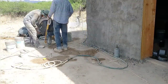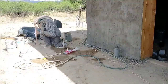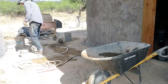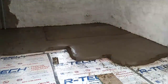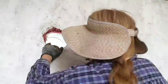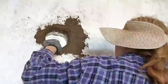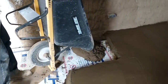There's a lot of good honest labor involved in this type of construction, and it's a lot of fun to be able to gather the materials you need from the land. We've harvested the sand from the land, we're sifting the soil from Kyle's own property, and we're putting that together with a little bit of Portland cement to make the floor. The end product is a really great floor — very natural, feels great to walk on, and is extremely affordable since most of the materials are free for the taking. In the meantime, April's doing some patch-up work around the portholes where some of the bags were sagging over the tube.